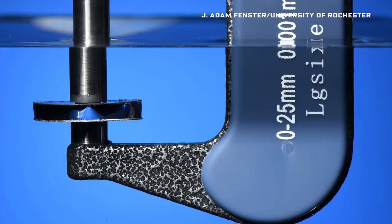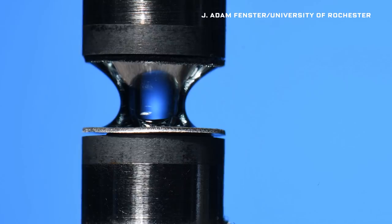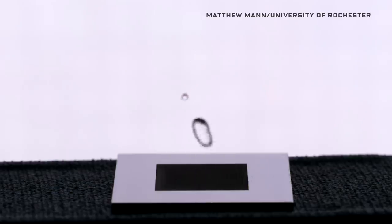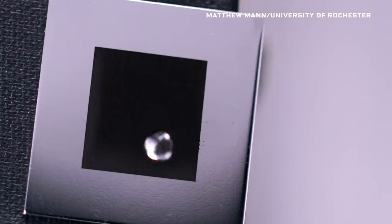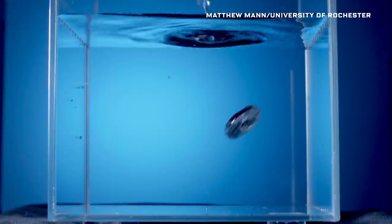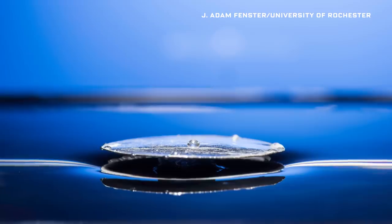Is this structure actually unsinkable? Based on extensive experiments, it is unsinkable. As long as the integrity of the metallic structure is maintained, you will not be able to push it down. If you rip open the metallic structure, the super hydrophobic surface alone is sinkable. We submerged it under forced conditions for two months, and as soon as the load was released, it bounced back up again. Based on all the evidence, everything points to it being extremely highly buoyant.